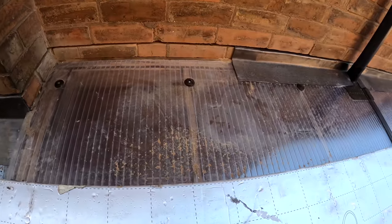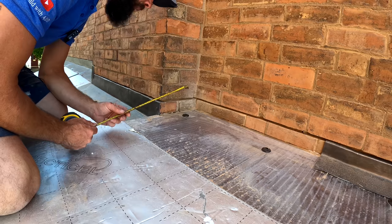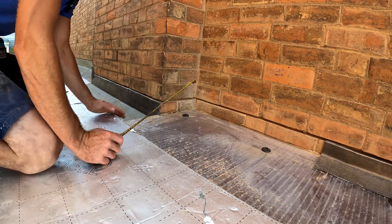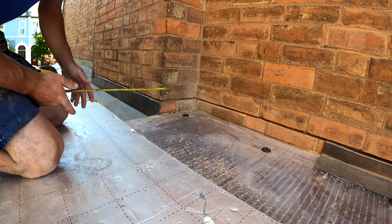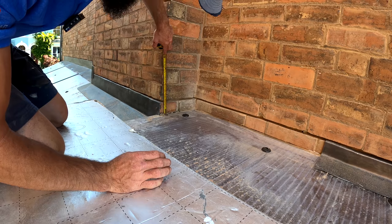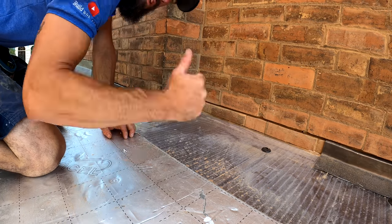I don't want to do this in too many different pieces, so I've decided I'm going to do this in one piece. What I've got to do is this piece has got to go on first, and then we're going to put a piece on here on top of that, and that should get it watertight. So the first thing I've got to do is get my tape measure and measure how big I want this piece of lead. We're working with 15 inch. We've got an inch up there, this is going to come to about here — cut this piece at 500.